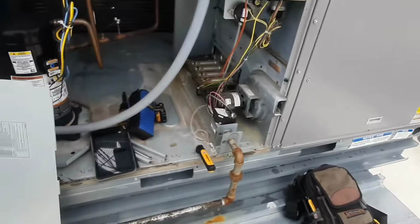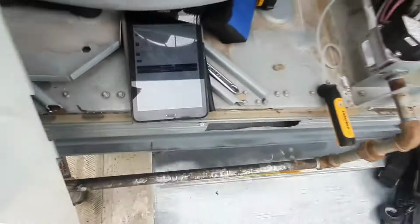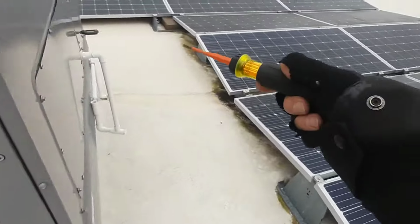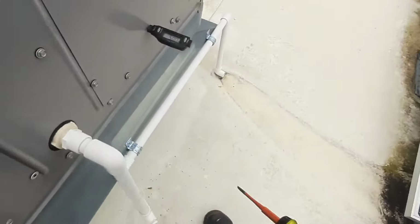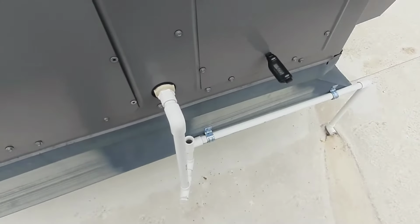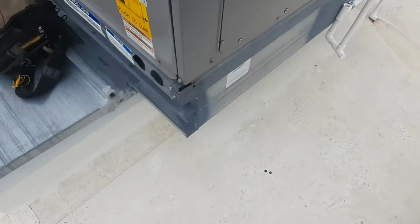If we need to adjust the blower we can. I think we're going to be okay. Actually, I'm showing a 68 degree return air, so my probe wasn't in the return air very well either. This is drawn from down, it's the second floor. But I got my probe all the way inside. Same way here, I'm all the way inside, so I'm getting a more accurate reading.